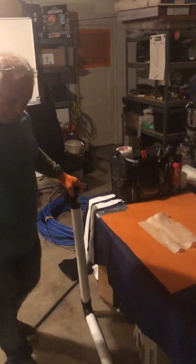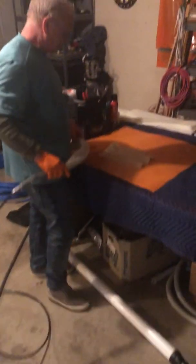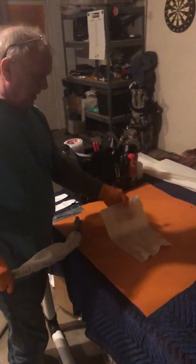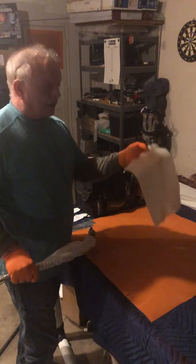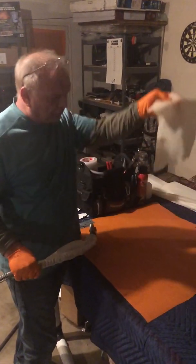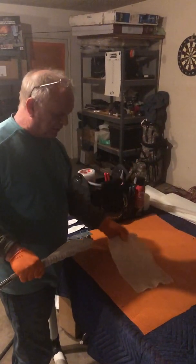Assuming we've got a little demo pipe we've put together, I'm going to show you quickly what we do on the spot repair. I've already cut it — it's ready to go. When you're doing this, you want to be in an area where there's no sunlight, because this is a UV-activated resin. And as you can see, it doesn't drip, it doesn't run anywhere, so it allows you a lot more flexibility and time.